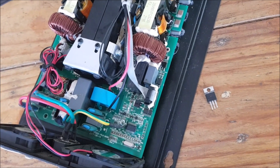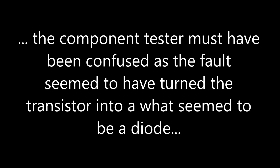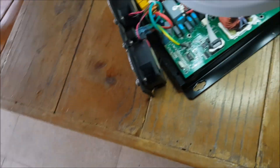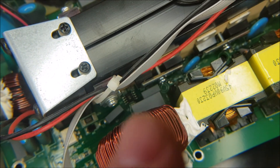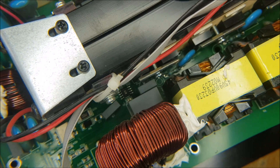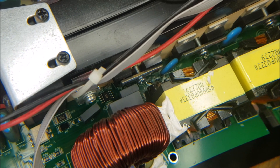I have not taken the component out — what I thought was a transistor actually tested as a functional diode. Let me show you something on the 2000-watt inverter quickly. You can see a small IC next to where on the other inverter I took off the diode. This is a gate driver IC for the transistors, and this one completely blew off the top.